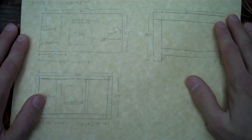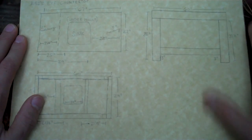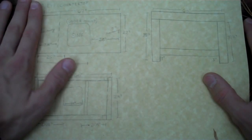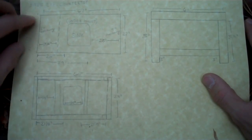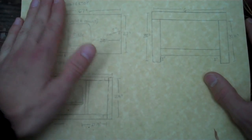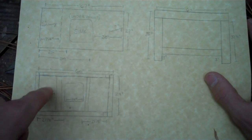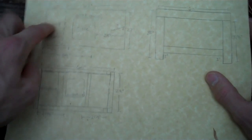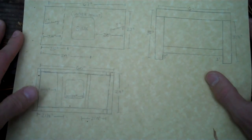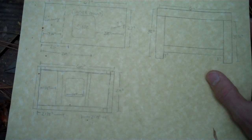This dotted line is where we'll cut the plywood. I like to have a dish drain to dry dishes because drying them with a towel takes too long. I make a cut in the plywood countertop and put hinges on the left side so it hinges up and exposes the under-cabinet cavity, where we put a dish drain. When done, the countertop closes back down — you'd never know it's there.